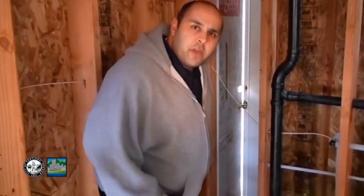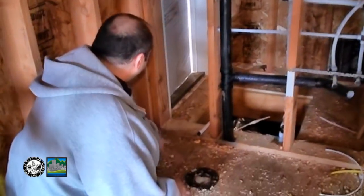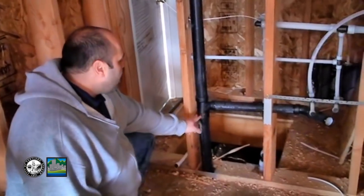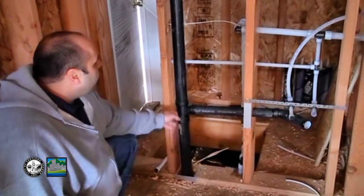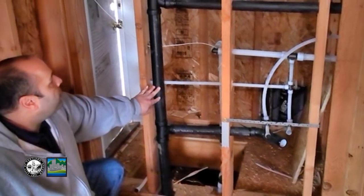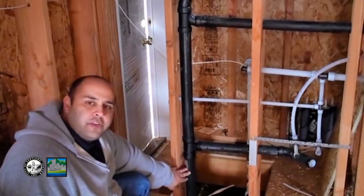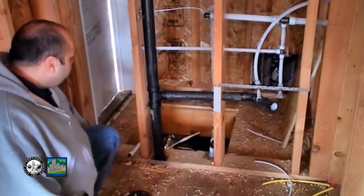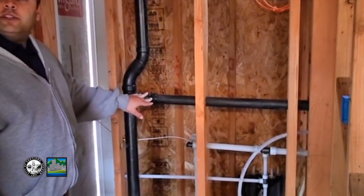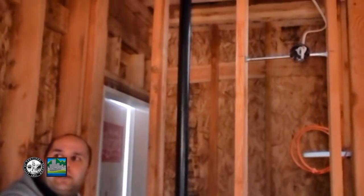We're here in the half bath of this home. We've got our closet flange here on the floor. That takes a minimum 3 inch pipe. The flange should be secured to the floor and it needs to be 15 inches from anything on either side of it. This is called a wet vent situation — specifically a vertical wet vent. We've got the 2 inch vent from the water closet and the inch and a half line from the bathroom sink that ties in here. This pipe acts as both the vent and the drain for this system — vent above, wet vent below. We've got our hot and cold supply and the cold line for our water closet. We also pick up the vent from the washing machine drain that we just looked at — it ties in here and then this 2 inch carries up and goes out through the roof.